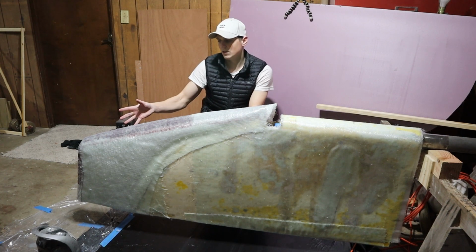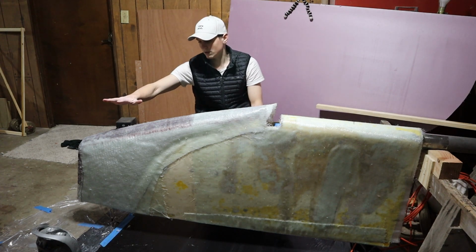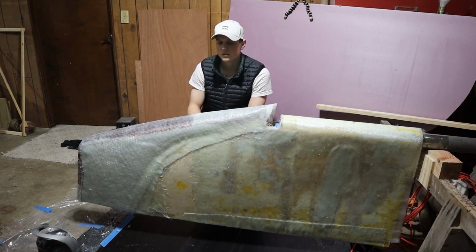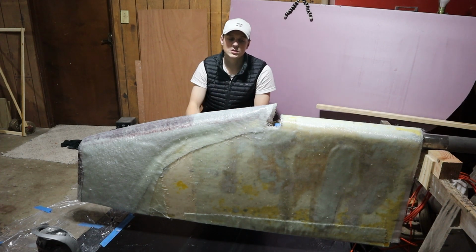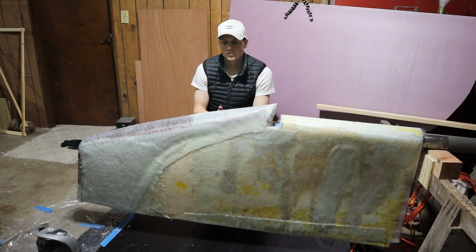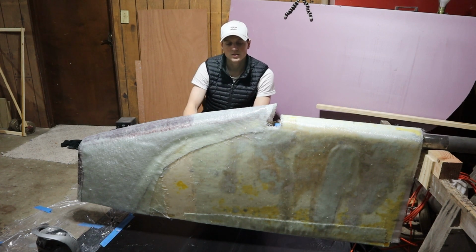From my understanding of what this will do for the performance of the boat, by putting this extra area in, it actually puts the rudder inside the prop wash, and so then at harbor maneuvering, when you turn, you actually push water with the rudder, and it helps turn tighter. From a backing up perspective, the extra depth and surface area helps a lot. And then, all hearsay from reading, it also helps with the weather helm in heavy weather sailing to have a little bit extra area. So we did that.